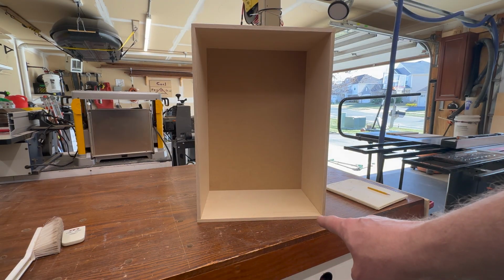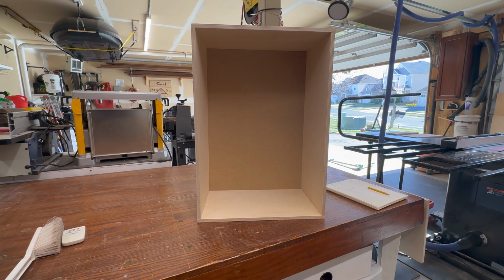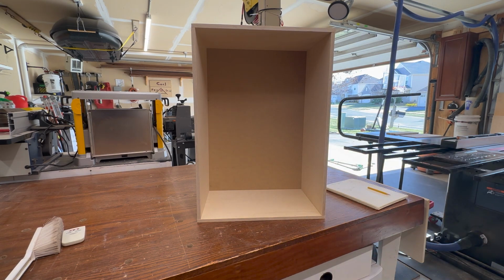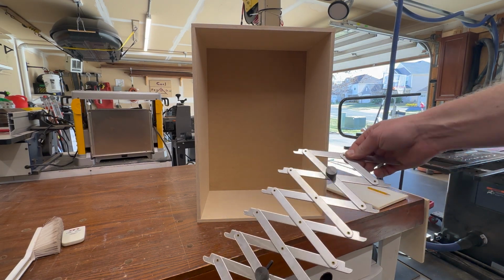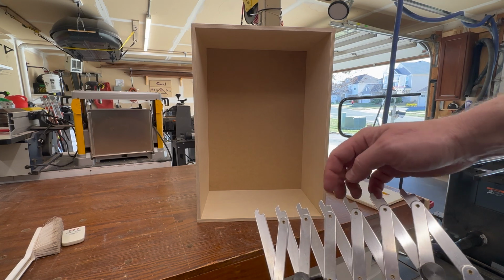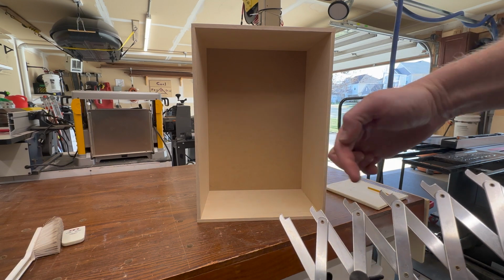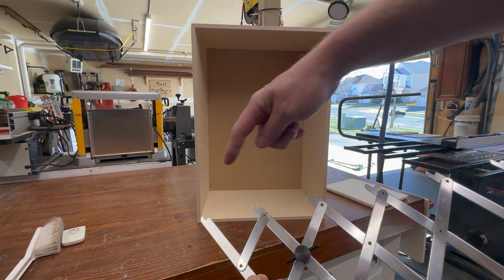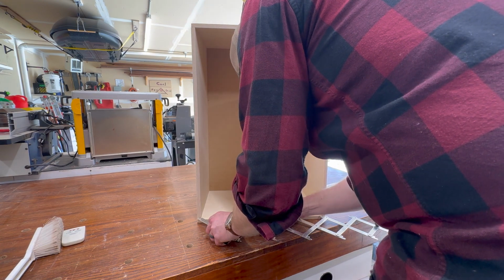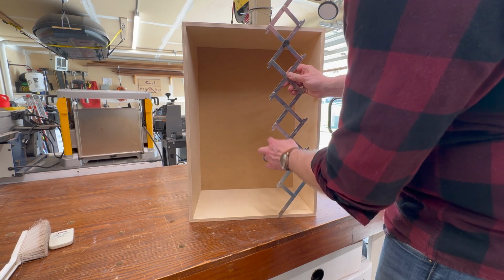I want four boxes across each of the rows, and then I need to figure out how many are going to fit up and down too, and that will give me my dimensions for the cross beams for these drawers, and then exactly what those dimensions are. So if you've ever seen one of these dividing calipers, it's pretty slick. If you're trying to divide it into four spaces like I am, I would just use the first five, one on each end, and then the spaces are what you want to measure. So one, two, three, four. However far I divide these, it will maintain an equal distance between each of these points. I can figure out exactly how many would fit in there. It looks like one, two, three, four, five, six.